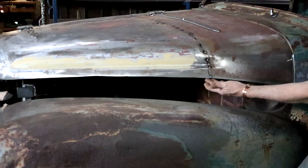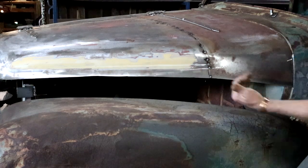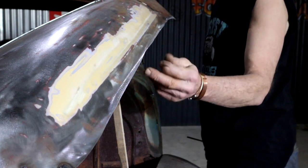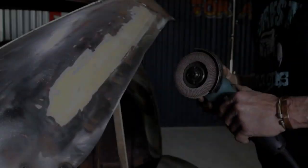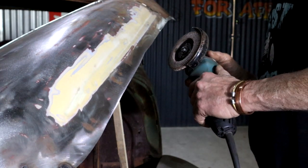This line is not nice and fair and sweet yet, so I first need to clean that up a little bit. You can see there's a bit of a dent there and some straight sections — it's not a nice flowing line. I'm going to use the grinder with a flap disc and try to smooth this out by eye.